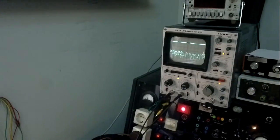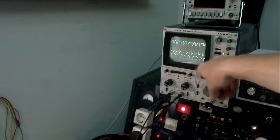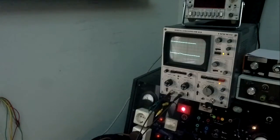What we can see is the first signal is almost a square wave, with still some slopes on the rising and falling edges — that's something I tried to tune. The output of the tone stack looks really wild, with a lot of overtones and spikes. These spikes are responsible for making this really bright, aggressive tone. If I turn down the treble, you can see there are none of these spikes or overshoots.